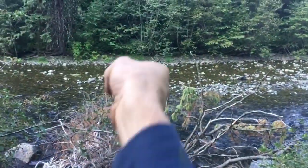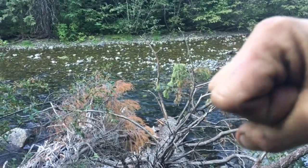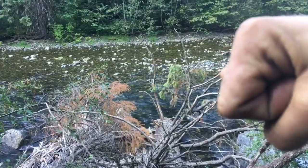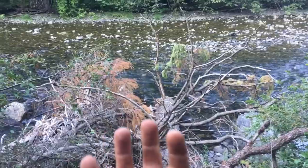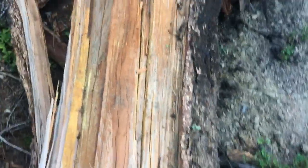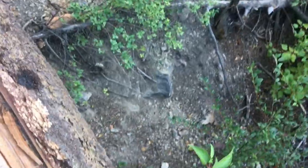And as we put the saw in and start pulling, those two pieces of wood that we create with the cut are then going to start to push into each other because of the tension on the fibers on the underside of the log. And so it's going to pretty much effectively just pinch our saw to the point that we can't pull it. And then the other issue here, well, one other issue is footing. The trail here totally sucks. There's really nowhere to even stand and cut the thing.